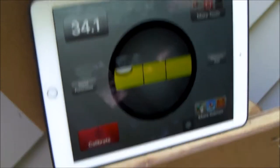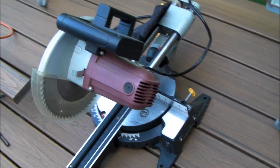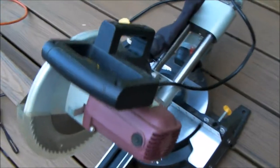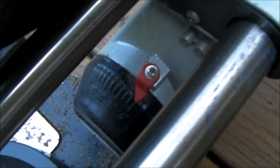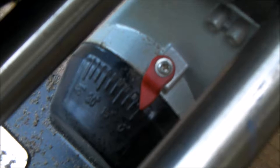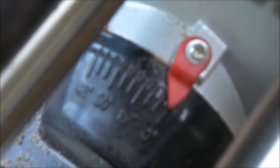Let me show you how you translate this to my saw. This particular cutoff saw is very inexpensive, and as you can see, the ability to get a very accurate setting is not very good. I needed roughly a 34 degree angle, and you can see from the graduations here that getting a precise 34 is not easy.